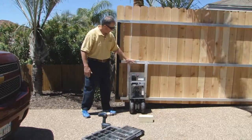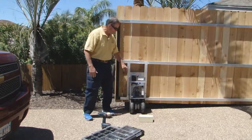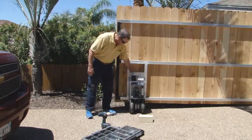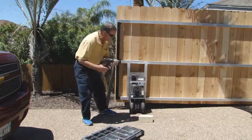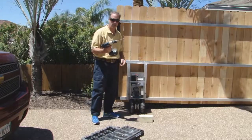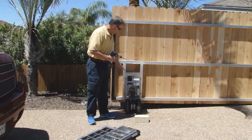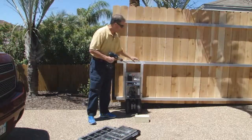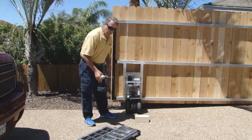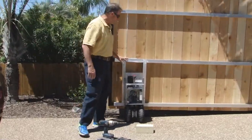But this style, of course, we already have the bars in place. We've lined up the Gator Power Gate and we'll level this so that it's straight up and down. Then we're going to use a three-eighths inch bit and drill four holes — two on the top, two on the bottom — to bolt this Gator Power Gate to the gate.